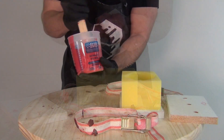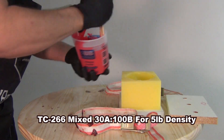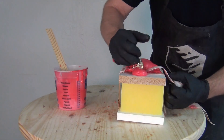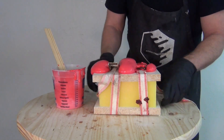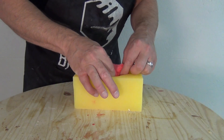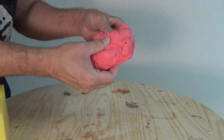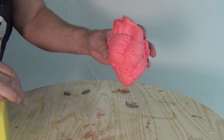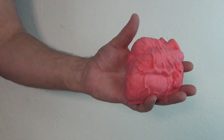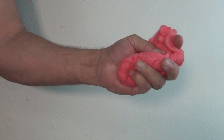The second foam heart is mixed up at 30 parts A to 100 parts B. We've already added our red pigment to part B, and we're going to pour that into the mold and allow that to rise. When we back off the part A down to 30 parts A to 100 parts B, that's going to result in a slightly denser foam that is actually a little bit more flexible. For people making puppets and things like that, where they need a more supple end product, they'll use that 30A to 100B. The 50A to 100B ratio and the 30A to 100B ratio are the envelope in which you can operate — you can adjust the A anywhere within those two points to achieve many different densities.